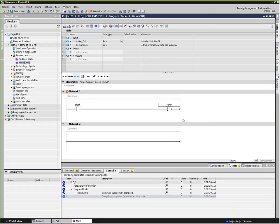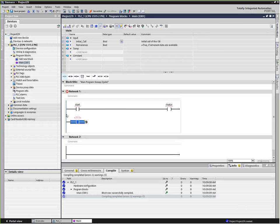That's not typically what we do with motors. Usually you push start and you want it to run after you've released it. So we actually add what's called a parallel sealing circuit. And I will go ahead and grab that, drop it down in here, and make a parallel contact that is also associated with the motor. So in other words, I push the button, the motor starts, this becomes true, and we can let go of the button, and after that, the next scan through the PLC cycle, it'll actually stay running because the motor contact is now on. Make sense? It does, with one exception.